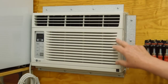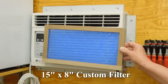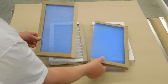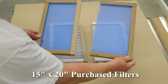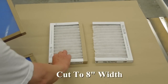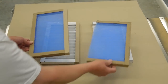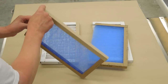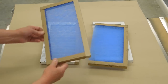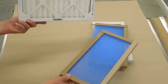This will require a 15x8 filter. They don't make a filter that size, so I had to make these myself. I bought two different types of filters — one-time-use filters, these were 15x20, and I cut these to 8-inch width. This pleated filter is wire-reinforced on one side, and now I need to replace the cardboard on one side. I'm hoping I can blow these out with compressed air and use them more than once — that remains to be seen.